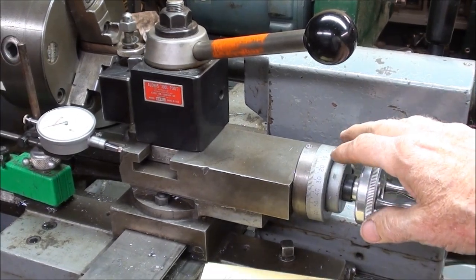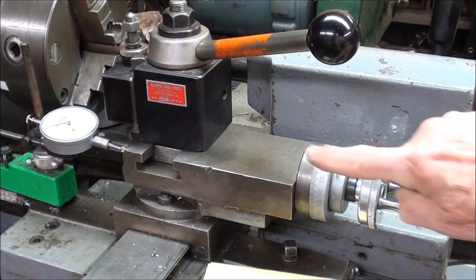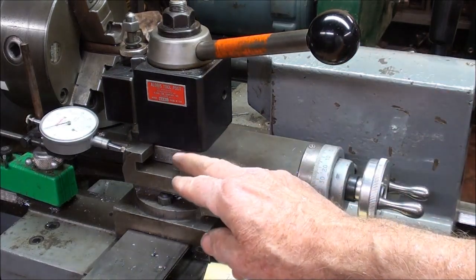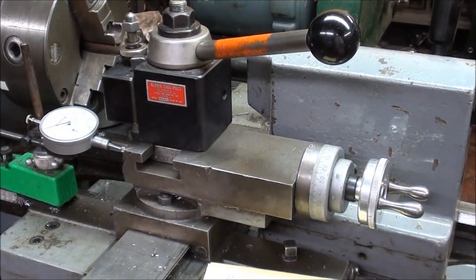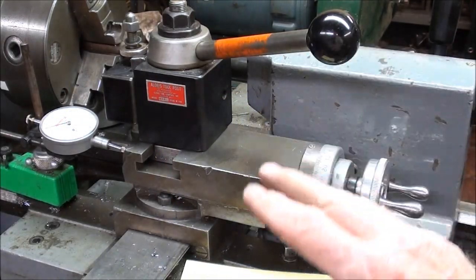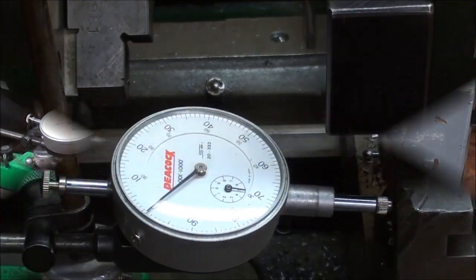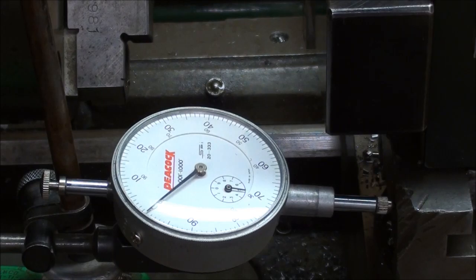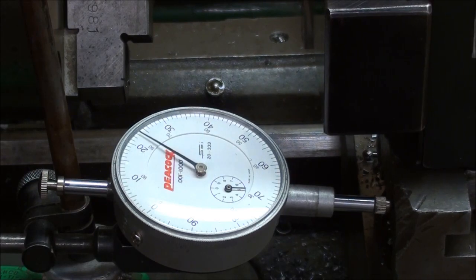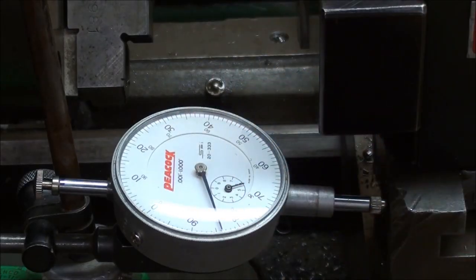During setup I told you to make sure the compound was on zero and that lost motion had been taken up — you had moved it in a little bit, zeroed it out, and made sure you had a little extra travel available, not at the end of your travel. Because we need to move it 84 thousandths. I prefer to use the dial indicator on a magnetic base — zeroed out — and I'll move it 84 thousandths toward the headstock. That is done, and I can take the indicator off. I'm ready to start the second cut.